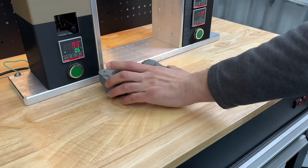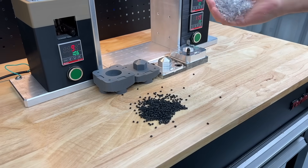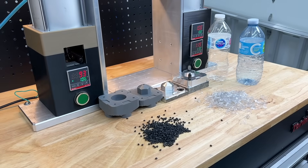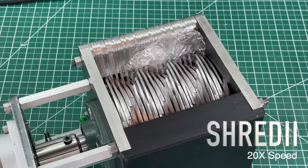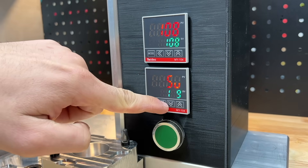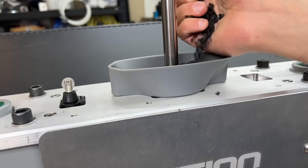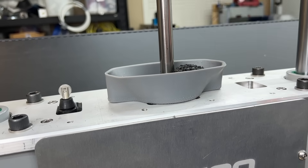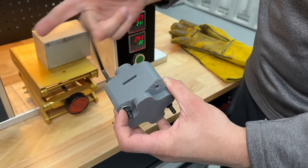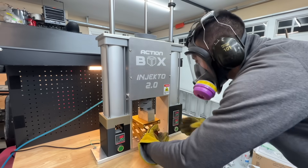We also 3D printed the exact same molds and are hopeful we can inject our ABS pellets into them. We're also hoping to use shredded bottles to recycle plastic waste from our DIY machine shop — shredded with Shreddy from last month's video. We set the temperature for each zone based on the specific plastic, slide in our ABS pellets, close the two halves of the 3D printed mold with four M6 screws, and line up the mold on our scissor table clamped to the nozzle.